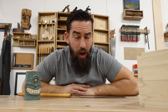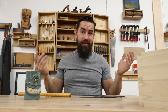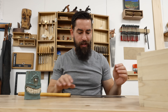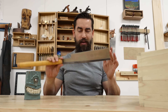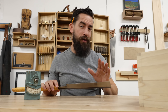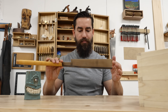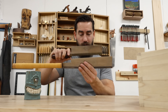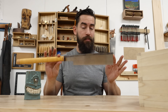Rapid fire Q&A. How's the quality of the cut? Really actually far better than I expected — basically on par with a standard western style, but I think it has to do with the amount and orientation of the teeth. This is a much finer tooth, which is what I prefer in a dovetail saw. Most dovetail saws are around 14 TPI; I prefer a 20. I don't know the exact TPI on this, but it's probably about that, judging against my gent saw which is about 20. So the quality of cut is exceptional — beautiful, wonderful.